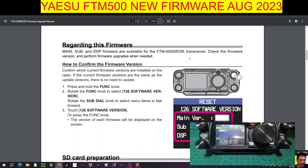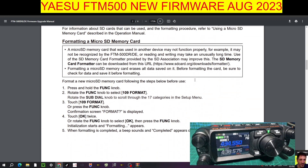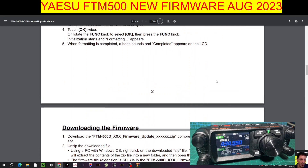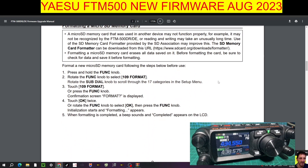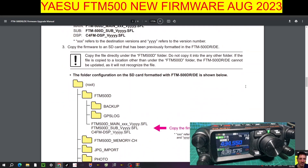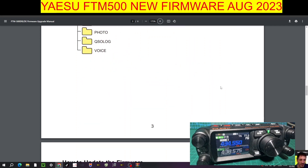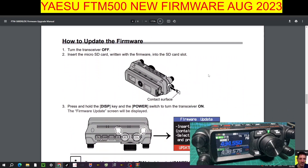Once you've got the files on the SD card and put it in the PC, press and hold Function — we've done that. It tells you about Format at menu 109. Downloading the firmware should be quite straightforward. Once you've done the format you'll have these files appear, and putting the SD card in your PC using a USB adapter you'll see the files need to be dragged into the FTM-500 folder — that is the FTM-500 Backup and GPS Log folder. It shows you where to put them and the radio should find them when you insert the card.